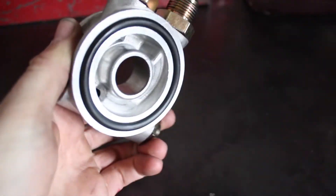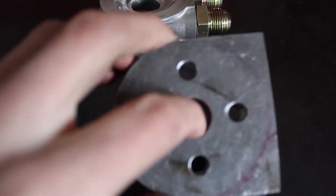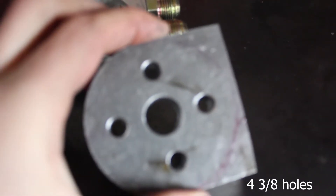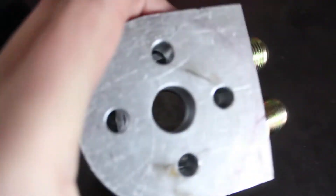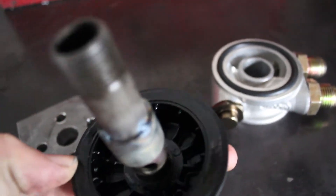Alright guys, here's the finished product. So first of all, got this guy off eBay. Then I took this piece and drilled a three-quarter hole in it — perfect fit. And then I drilled three three-eighths holes around that line up. So basically the oil can go back — that's the outlet for the oil. And then I took that fitting that fit into here with the threads on it, I cut it off, drilled it out, and welded it on to this. It's not a pretty weld but it doesn't really matter because it's not that much pressure, it just needs to stay there.